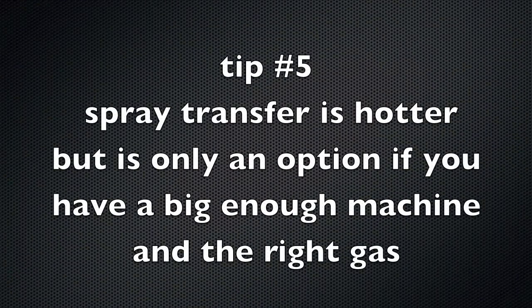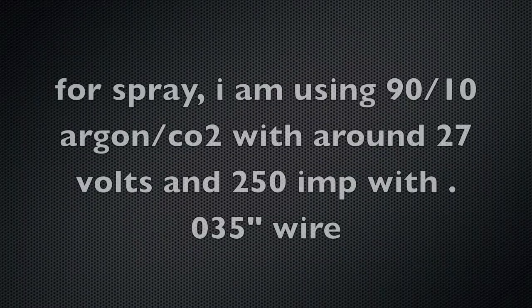All right, spray transfer is another method. It's really hot, but you can only do it if you got a big enough welding machine with high enough duty cycle and the right welding gas. I'm using 90-10 argon CO2 here today. You got to have more volts. You can't get into spray unless you get way above like 25 volts. I think I'm using about 27 to 28 volts here, probably about 350 inches a minute of wire